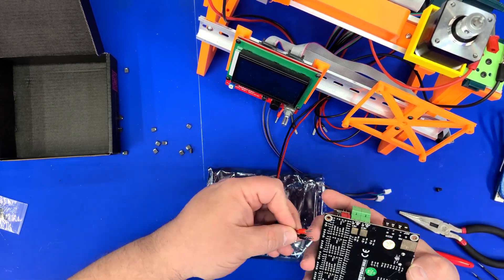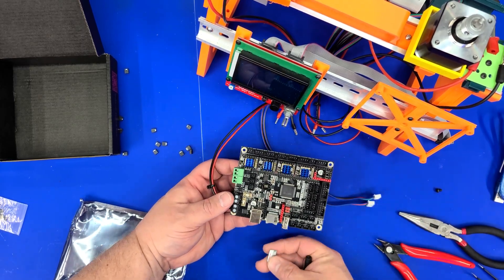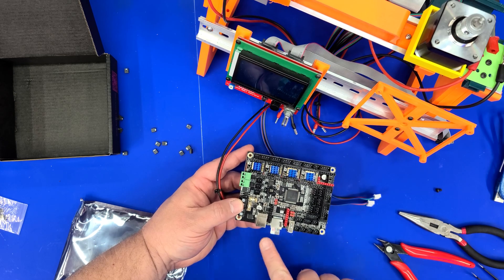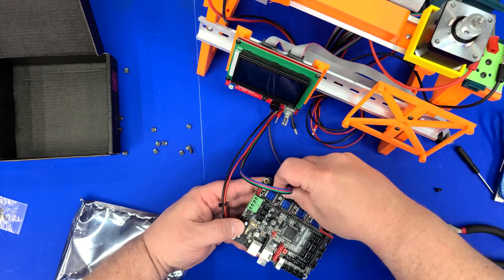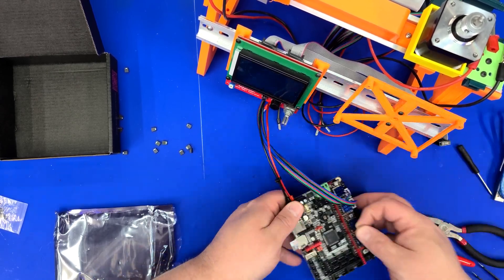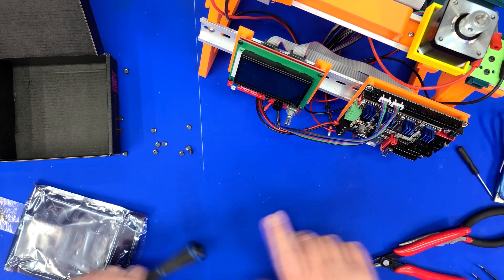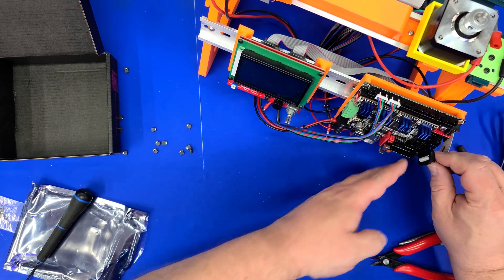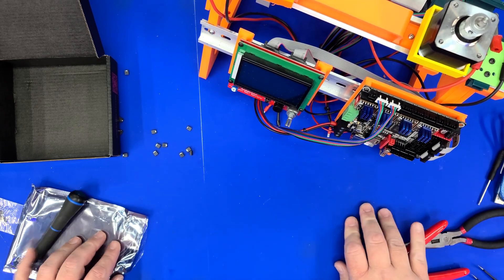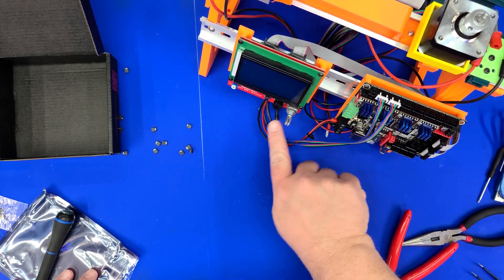I'm just going to check that we're set for external power and hook up our leads to the board. I've got the firmware supplied by BigTree Tech on my SD card, so we're just putting that in there. Remember, these don't have the spring-loaded mechanism, so we're just going to push them in. Then we're going to hook up a couple of steppers, screw this in, install the display, and we'll be ready to run our test. Power supply hooked up, steppers, step sticks in the proper configuration, SD card - we're ready to turn this on for a unit test.